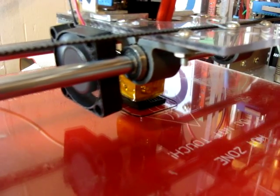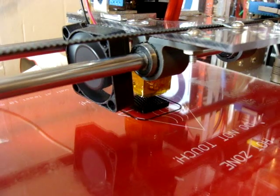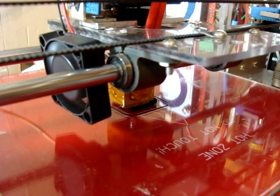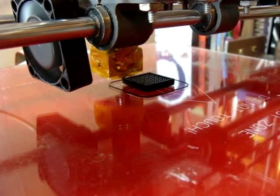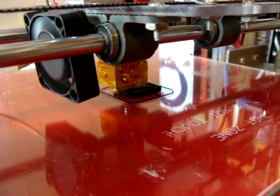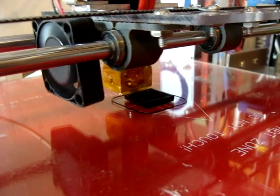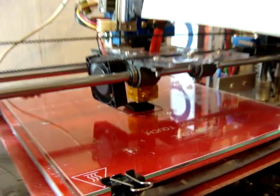I do have a little bit of a problem right now — the left corner of that block has come slightly loose, so it might come loose and fail. That's the standard 20mm by 20mm by 10mm test block being printed. You can see that back left corner has come loose, so this will probably be a failure. What happens is if it comes loose it curls up, and when it prints there it pushes down and causes the opposite side to come up, which generally leads to a failure.